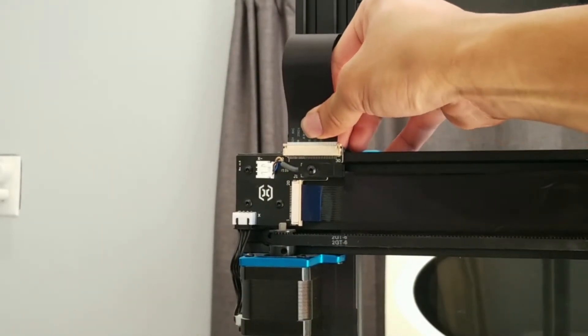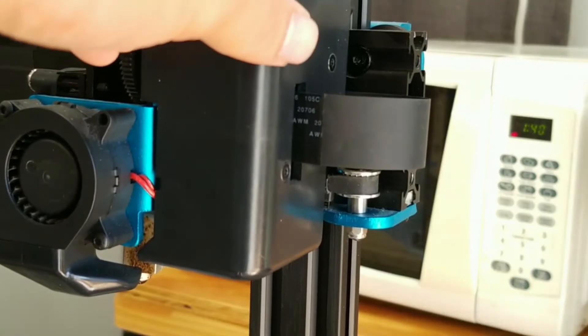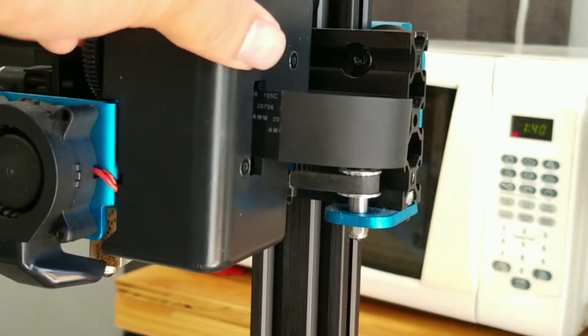A couple of things to keep in mind: make sure this cable is plugged in right here — if it isn't plugged in, you're going to get a negative 15 degrees on your LCD screen, and it took me a little bit of time to figure that out. Another thing is this cable needs to be able to clear the belt and pulley system. I found that mine was clipping the end of the wheel on the right side, so I had to readjust my cable to where it was a little bit higher along the aluminum extrusion. If you've already installed it, be careful to slowly remove the ribbon cable as the glue might rip off and you might have to re-glue it.